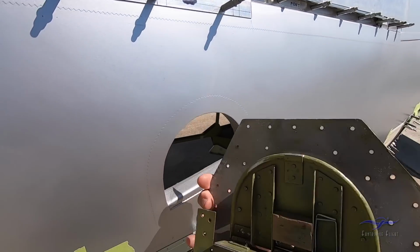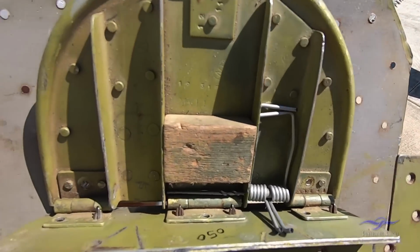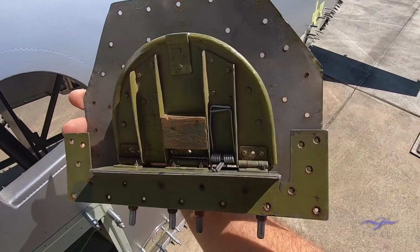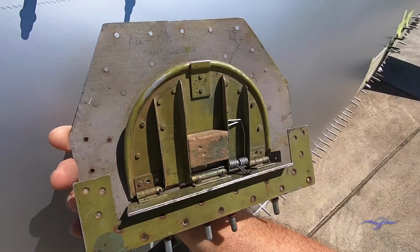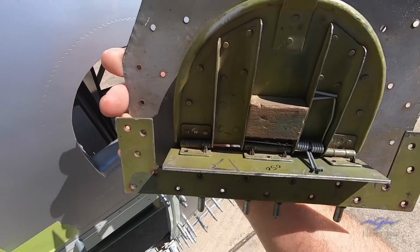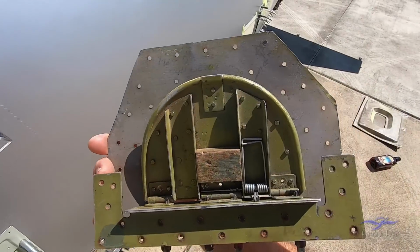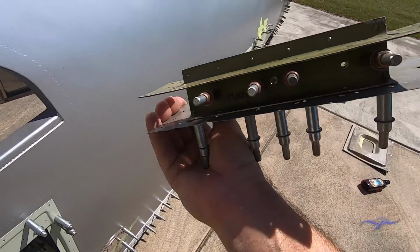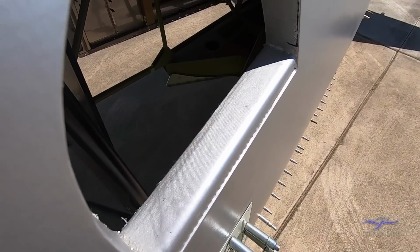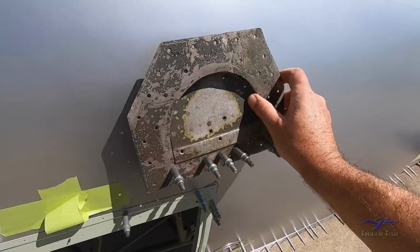So on the inside of this assembly, you can see a couple of springs there. They actually also get duplicated on this side to give enough spring tension to return the step to the closed position once the pilot steps inside. A little bit of a block of timber there just to rest on this bit of an aluminium shelf to not damage any of the aluminium as the pilot's weight goes onto the footstep itself. It's also spread a fair way between the internal and external plates to make allowance for the thickness of the timber shell in this area. So that whole piece goes in there.